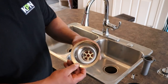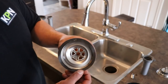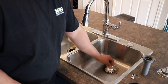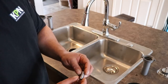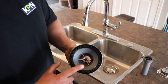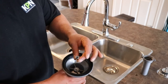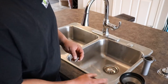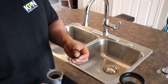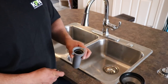It works just fine. And on the strainer there's a marking on the top — it's a little crown. You want to install that facing straight up just for aesthetics, so we'll slide that in just like that. Then we have the bolt here, which connects the strainer to the basket. Inside the basket there's a little piece inserted with metal threads that this will tie into. And below we have the tailpiece — make sure there's a little rubber gasket to make a proper water seal underneath the sink.